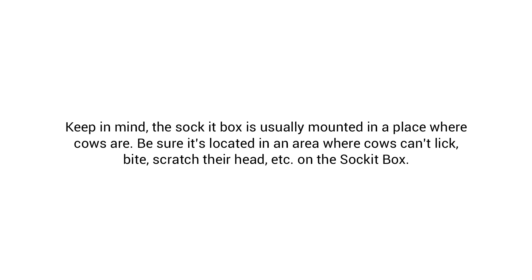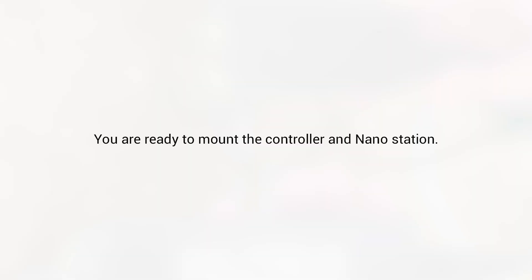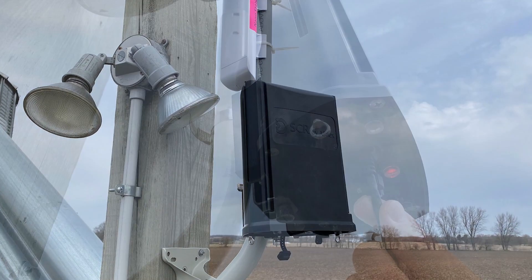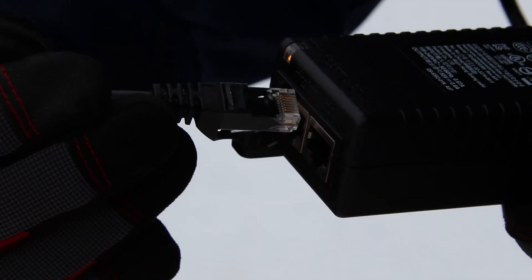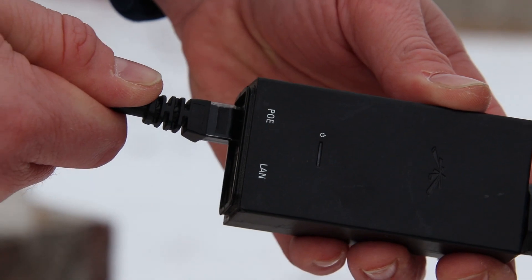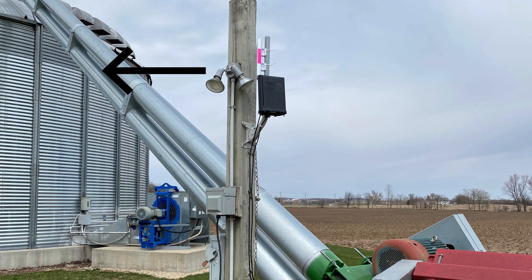Once the socket box is mounted, plug the 55-volt power supply and the 24-volt power supply into the outlet and place them inside. You are now ready to mount the controller and nanostation. Using four screws provided, secure the pole mount no less than six feet off the ground. Plug one end of the Ethernet cable into the PD port of the SenseHub controller and the other end into the data and power port of the SenseHub 55-volt power supply. Plug the second Ethernet cable into the main port of the nanostation and the pole port of the 24-volt Ubiquiti power supply. Use a short Ethernet cable to connect the LAN side of the 24-volt power supply and the data port of the 55-volt power supply. Point the nanostation towards the nano access point. Point the controller towards the area where cows are going to be monitored.